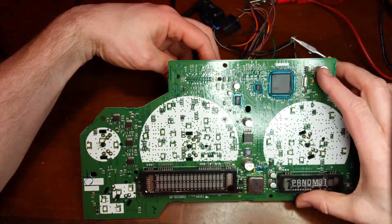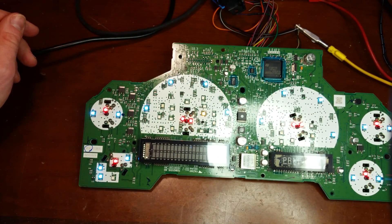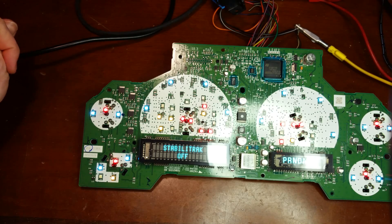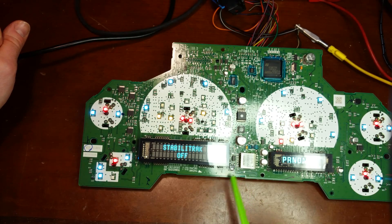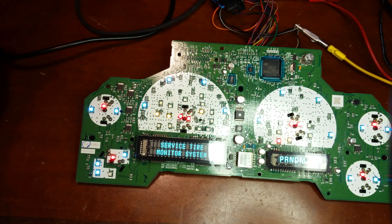Okay, get the leads from touching. And go. Hey, look at that — we're okay! In this case the MOSFET didn't fry the board under it, it didn't cause any damage to the board, so it didn't cause any unintended short circuits. This was a pretty clean, straightforward fix. I'm going to give it just a few minutes to make sure no magic smoke escapes, but I think we're good. I'll go ahead and test it for a bit and reassemble.